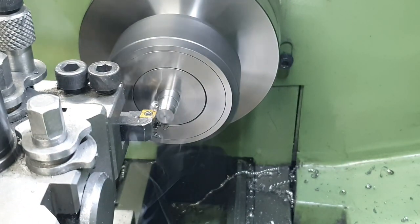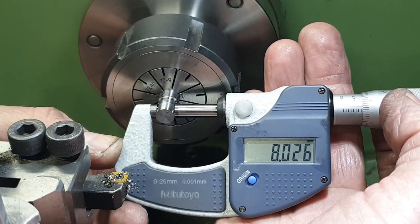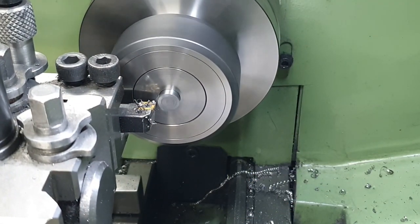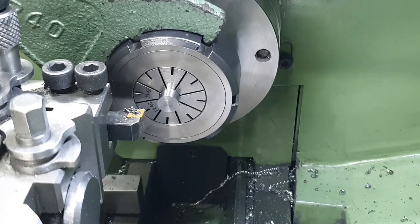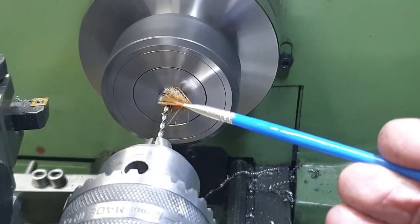In fact it's 8.04mm because I ran the reamer a bit fast — 8.03, slightly undercut. With the shoulder turned I cut off the crank pin from the rest of the stock, stick it back in the collet chuck, face off the end, pop it out, measure it and then face off to length. 9.5mm.